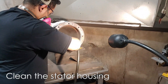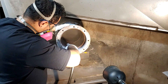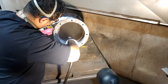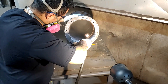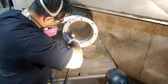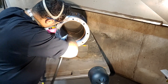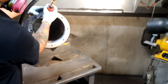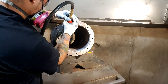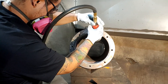The first step in the process is to clean the stator housing — inside, outside, all our o-ring grooves. We're going to use a wire wheel and a flapper, as you'll see here, to prepare it to drop the stator in. Use the flapper in the larger areas because you're taking bigger swipes. The wire wheel gets into where the o-rings are, in the corners the flapper won't reach.